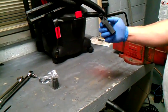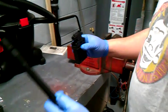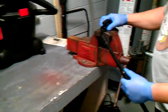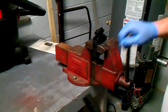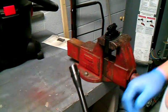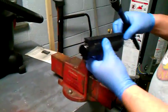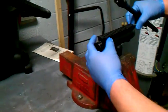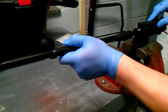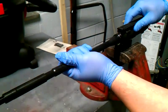What we've got here today is the bed block, and we're going to show you how to install an AR-15 barrel onto an AR-15 upper. What you're going to do is lock this into a vise, preferably a bench vise. Then you take your upper and put it on top of this, and slide your barrel into the bed block.